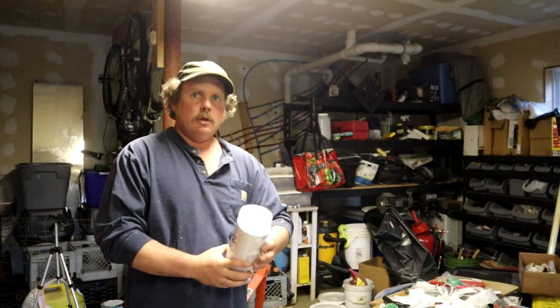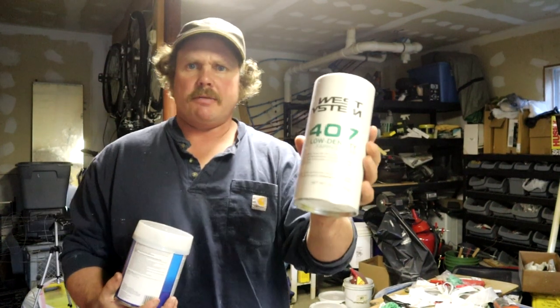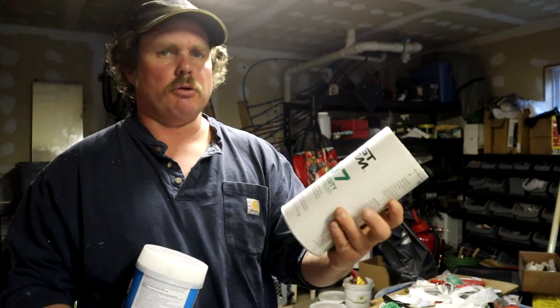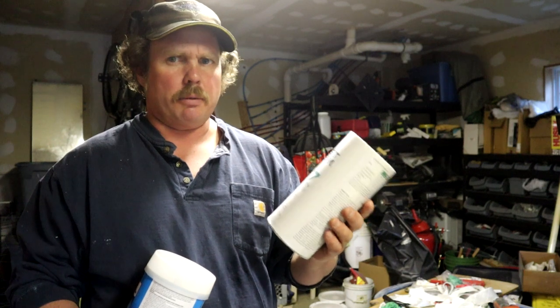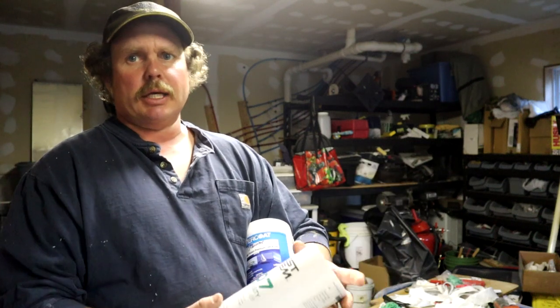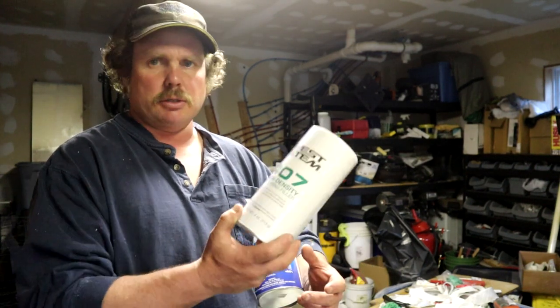All right. So I want to share this with you before I stop for the night. 407 low density filler from West Systems. There's also a 410. 407 I think is a little bit harder to sand, just a little bit, than the 410. So this is going into an application where I want it to be able to take some lumps and bumps. You know, you might hit bottom from time to time, that kind of thing. So the 410 is a little softer. I think this is the way to go.